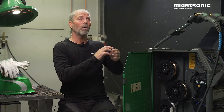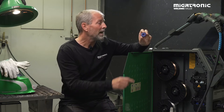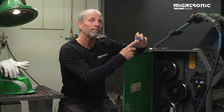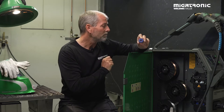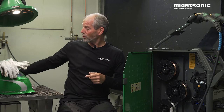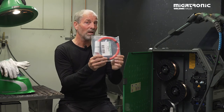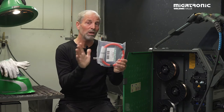For one millimeter wire we have the blue color for that dimension, and I choose a V-track for brazing. If we take a look at the hose, you can use plastic liner or Teflon liner — no steel liners.